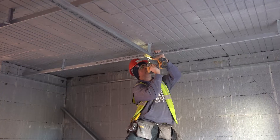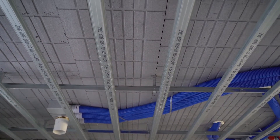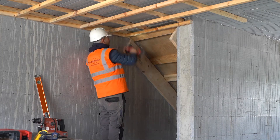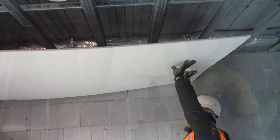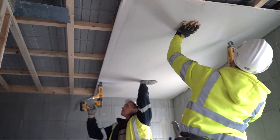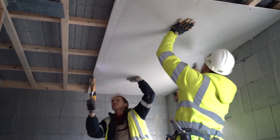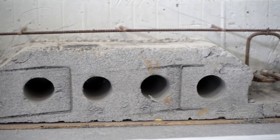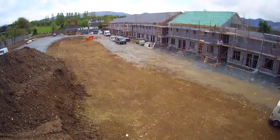Internally, grids for false ceilings or battens for plasterboard are fixed to the underside of the floor panels through to their internal C sections or to the concrete structure above. ThermoFloor gives you a solid insulated concrete floor, which provides an excellent sound barrier between floors, whilst vastly reducing your build time.